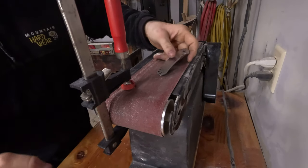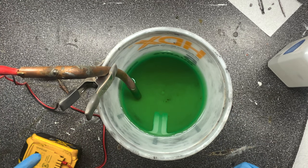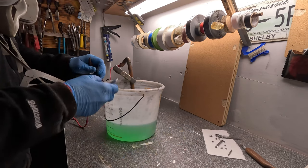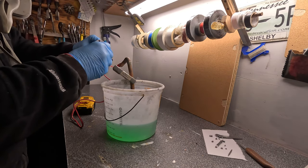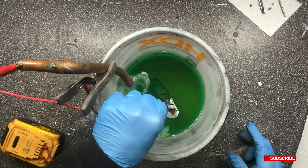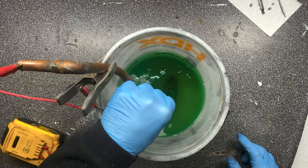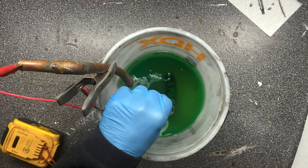I've got my copper muriatic copper solution, just an old copper pipe hooked up to the positive, a 20-volt DeWalt battery. Scales are cleaned with some alcohol — I'm out of acetone, otherwise I would use that. Let's dip them and see how it works out. I'll hook them in between the pivot and the button. You'll see it when I've done this in the past — you'll see it start to scale, so you can leave it in there for a really long time, but once it forms that scale on top it doesn't seem to plate anymore. I'll let it finish bubbling and put my respirator back on.